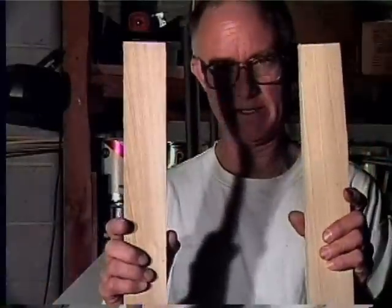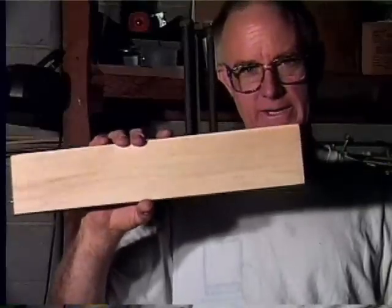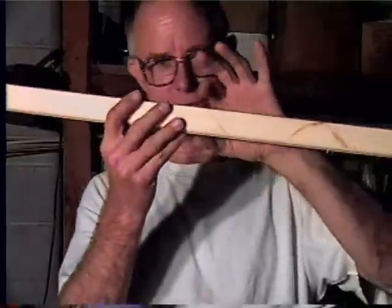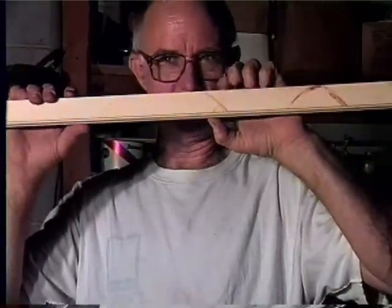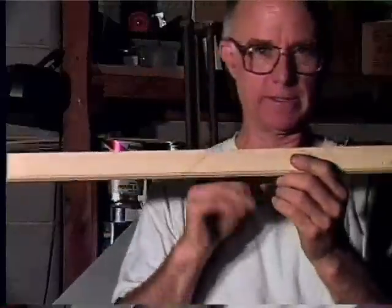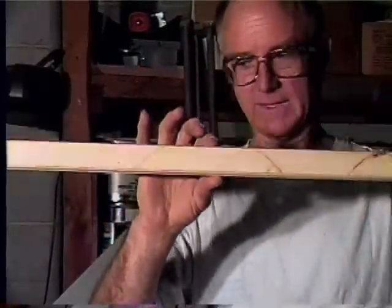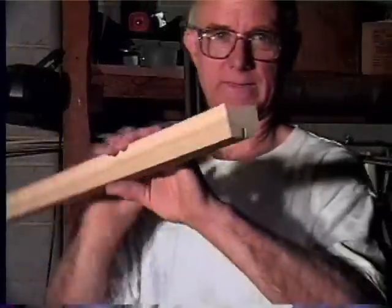Other than that, then the regular double hung window, usually 2-inch side stiles, 2 3/4 to 3-inch bottom rail. The check rail is usually 1 1/4 to 1 1/2. 90% of them are 1 3/8. But the older ones, you go back way back, they're sometimes 1 1/2. But in this case, we're going to use 1 3/8 for the upper check rail.